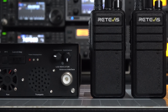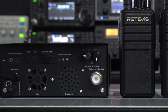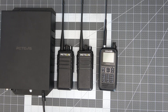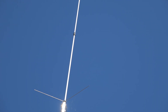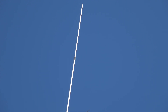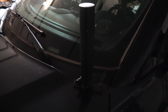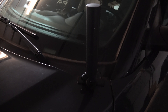So since these are LoRa radios, which again stands for long range, will they outperform other digital radios? To test this I hooked up the repeater unit to a tri-band antenna on my roof and drove to various spots with increasing distance with one of the handheld radios to see how far I could get before I was no longer able to receive a signal at the repeater. For an antenna while mobile, I had the handheld hooked up to a tri-band antenna on my vehicle.